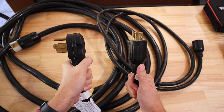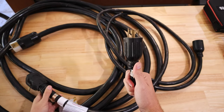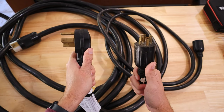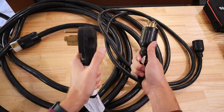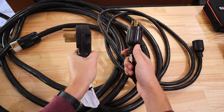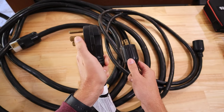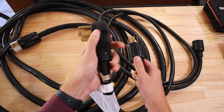This is even more dangerous because you're going to have 220 volts running through it, with wire capable of handling more amperage than your standard extension cord. If this is a 30-amp cord and you plug it into your generator, twist it into place, and then take the male end to plug it into the dryer outlet or a welding outlet — this is a lot of exposed metal with a lot of electricity running through it, looking for something to connect to.